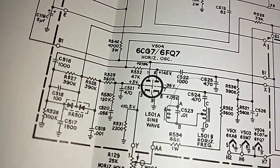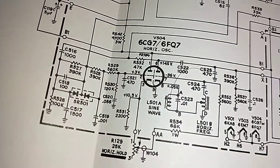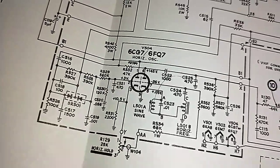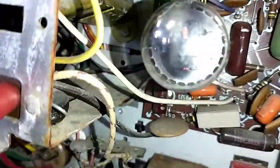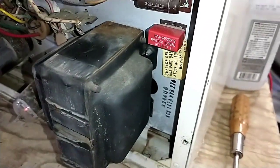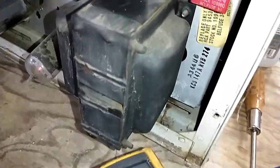And that comes from the 560K resistor, which I think was good. Which comes from, don't mind me. And we checked 529. So what's on the other side of 529? Let me just double check. And my sweep's starting to disappear, so something's getting upset. 528, 529. Okay, so 529 up here, diddly squat, 529 other side, still diddly squat.